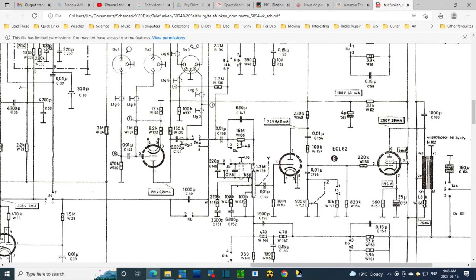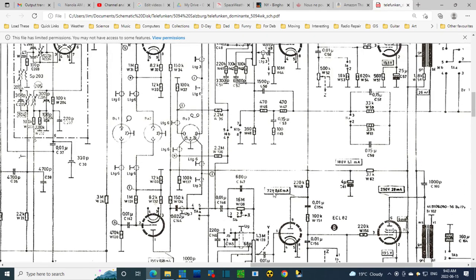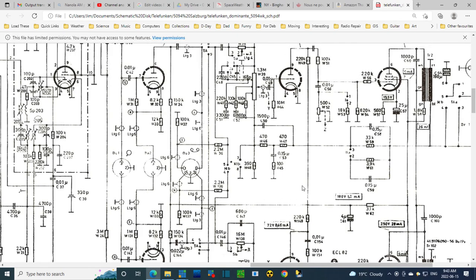I think the other part of the story is, what about all those old capacitors? I think they all got to go. That's a lot of work. Now, getting back to the other question, did I hook up the inputs to the right place? So where have I hooked them up? I've hooked them up on pins, if I numbered them in order, it'd be 4 and 5. I figured out that it would be these two pins. So I'm pumping a signal in here.